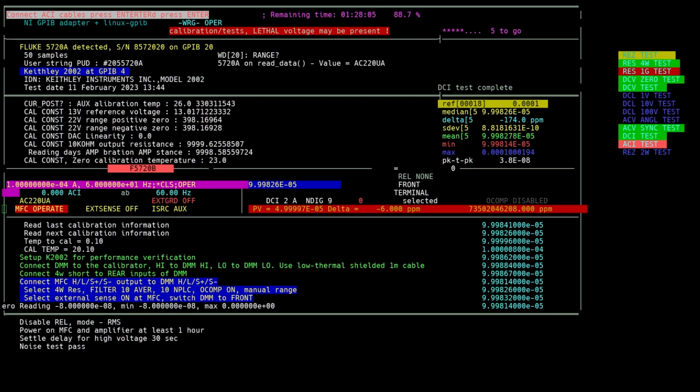And here is the glimpse of internal XDEV's software that running different calibration points and steps to generate a report, so I don't have to sit in front of the meter and press the buttons and mangle with cables all day long. So I can do other things like a full-time day job and things like that. I've been developing this software internally since 2016, and it supports a variety of different instruments, including Keithley 2001, 2002, HP 3458A, and so on.